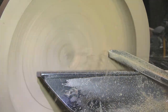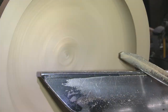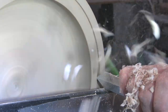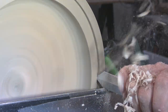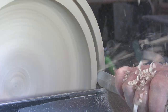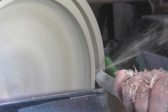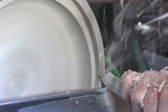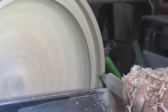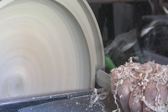If you hate sanding, it is important to have a sharp gouge and that your tool work is good. If you have those things in place, that will really limit how much sanding you will do, and you'll actually save money in the end. What I'm going to do here is cut a groove in the very top of this piece, and I'm actually going to expose both sides of the resin pour the next day. That's why this groove is really, really wide — I want to make sure that I had lots of thickness there to expose the rim.